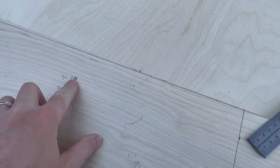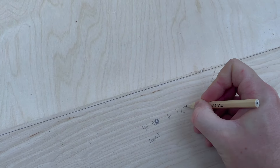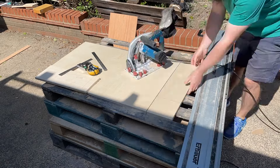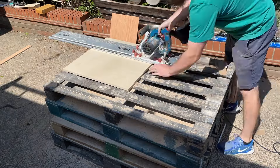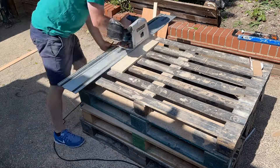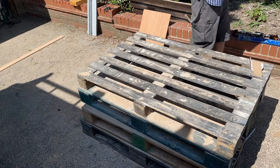One of the reasons we went for this sliding bed design is because we wanted lots of storage underneath, so we set about making some drawers. When you make drawers you need to remember to take the width of the aperture plus the runners into account. I cut down the sides — opting for 16 centimeter high sides on the drawers because they fitted well — then cut the sides at 55 centimeters each, before cutting the front and back and then realizing I needed the jig I had taken apart earlier. Since I'd cut up my jig, I needed to make another one.